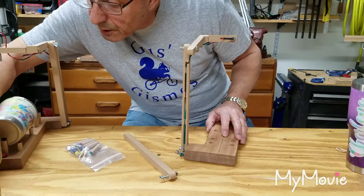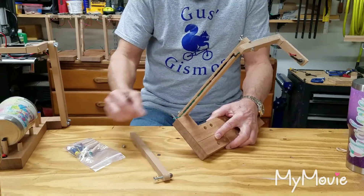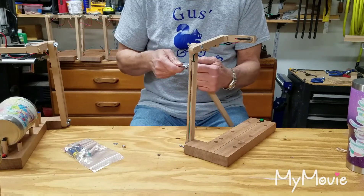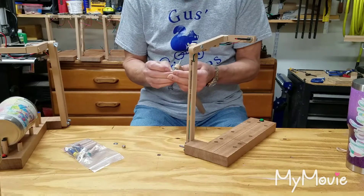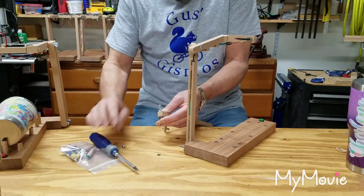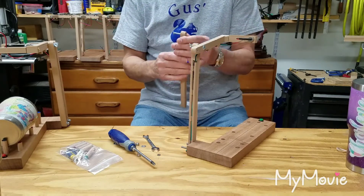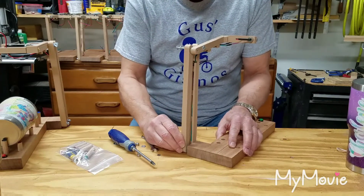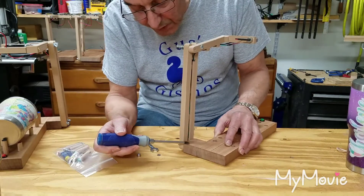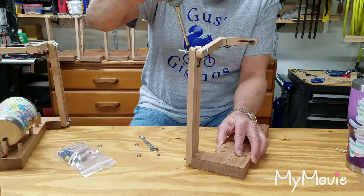Then you're going to take a 9mm wrench or a pair of pliers and back out this nut right here — a nylon lock nut — and the same thing on the other side. Take this screw, put it in the bottom all the way in, put the washer on the outside. The washers will always go to the outside — never between the base and the plastic.